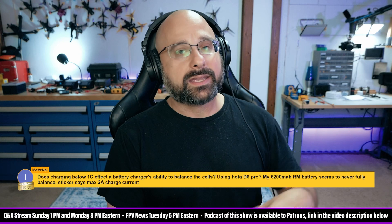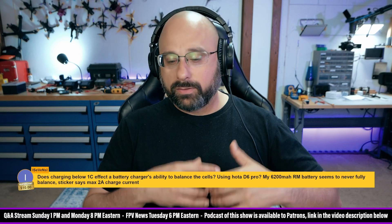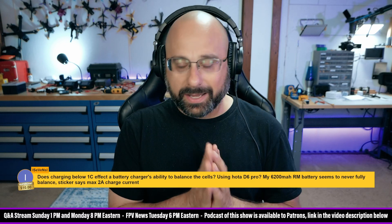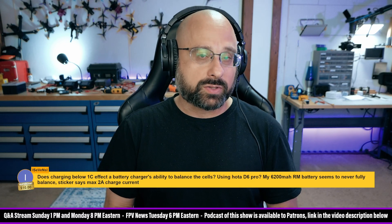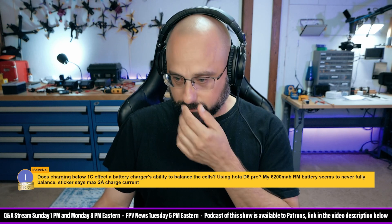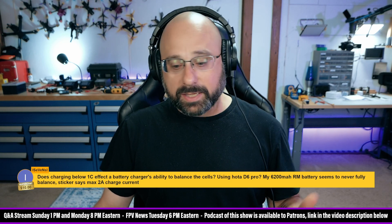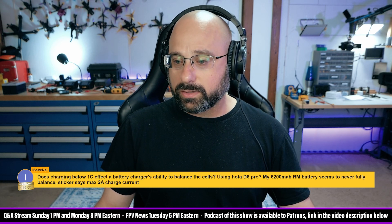I'm not saying — because we just don't have enough information here in the chat — I'm not saying this battery is dangerous, throw it out, it's going to burn your house down. But I am saying that we are potentially in a dangerous situation that we should really try to be aware of. If it's refusing to balance, it makes me think that last cell is damaged — like the internal resistance is too high or something.